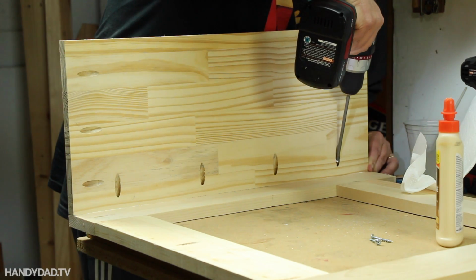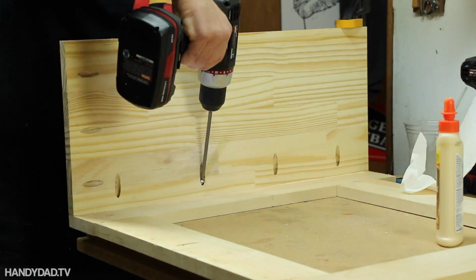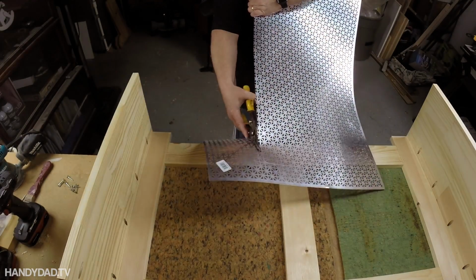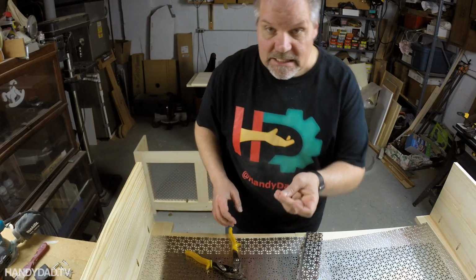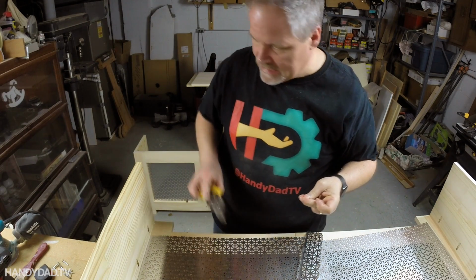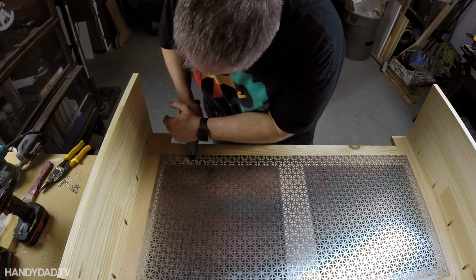In case you're wondering, steam radiators like these don't get very hot, so there's no danger of the wood catching fire. A radiator cover consists of a face frame, 2 sides, and a top. Aluminum screening is attached to the face frame for good airflow. Stuff is sharp. Be careful. Dang! Plus, I held the face frame up from the floor a couple of inches to let cool air in.